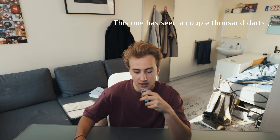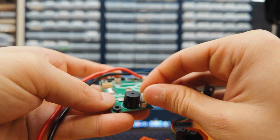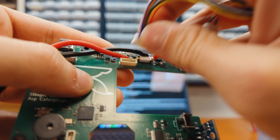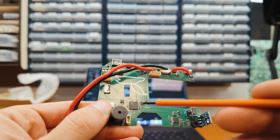The star of the show is our own PCB. It uses an RP2040 as the main microcontroller with a USB-C port for firmware flashing, a high-side switch to turn the blaster on and off digitally, and a fuse to protect against overcurrent on the battery. The trigger switch and distance sensor are all on the PCB, which helps during assembly. There are connectors for all low-current communication lines like the joystick, ESC, and display. It is completely soft-mounted to protect components against the hard shocks of the solenoid. There's a gyro on board for eventually adding safety features, auto turn-off, and possibly detecting dart firings. There's also an LED for status indication, an FPC connector for the display, a speaker for user feedback, and a full-bridge driver to drive the solenoid in rapid decay.